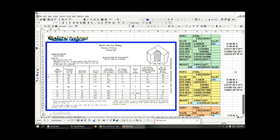So in this slide, it's similar to the previous slide. I actually tried to replicate some of their numbers in the rows. Like here, I tried row 1, 2, and 3. So row 1, I believe, is saying that it's a 3/16 thick plate with a 5/32 weld and a 5/32 electrode size. And it's got like a 9.5 inch per minute melt rate for the electrode and 10 inches per minute on the first pass. And you're supposed to get 0.08 pounds of electrode per foot of weld.